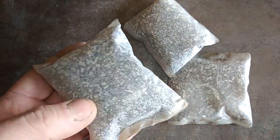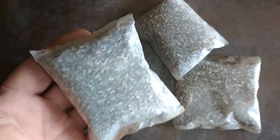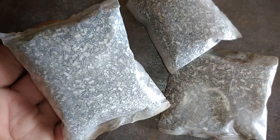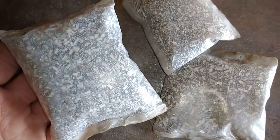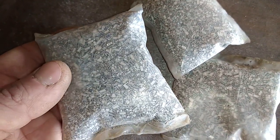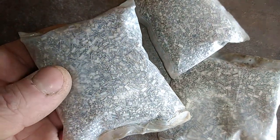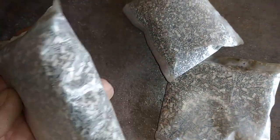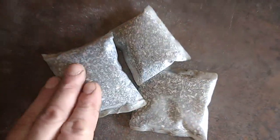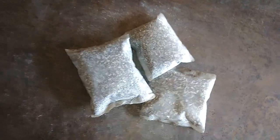Today is just a test to see if there are any noble metals and how much noble metal we can expect from this material. Right now this material goes into a nitric acid batch to dissolve all the base metal and everything else. Let's put that in the beaker and let's start.